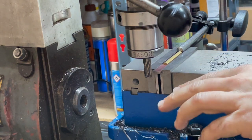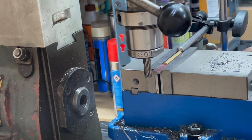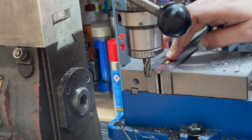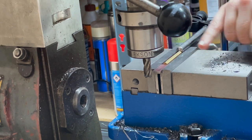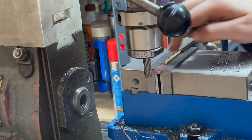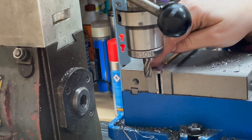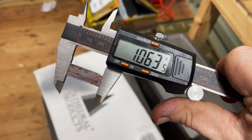This is a setup much like we saw for the horn stays. I have a stop here and a little buffer piece in the middle because my stop doesn't reach all the way across, and these are the spring plates. I'm going to mill off the ends of these and then replace them one by one so I get them all to exactly the same length.